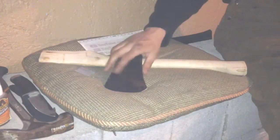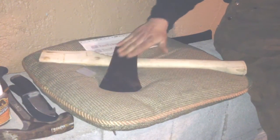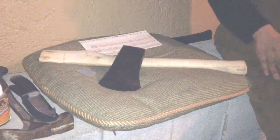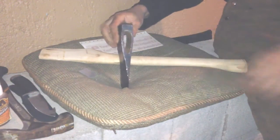It's sad but that's the way the world works nowadays. I wanted to get an axe handle to fix this. It's an older axe head with a little bit of weight but not too big - it doesn't take a huge handle. First thing I did was remove the iron oxide with the wire wheel on the bench grinder. Then I put an edge on it because it was a little dull, so it's pretty sharp now - I did that on the bench grinder also.